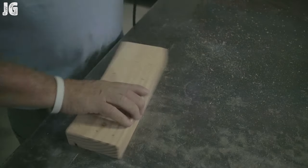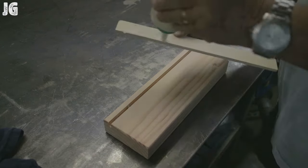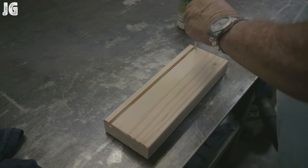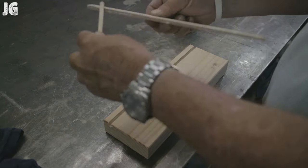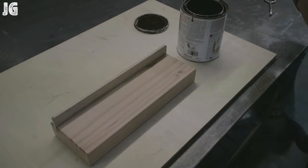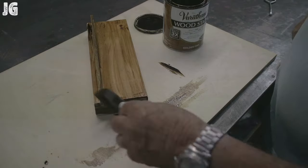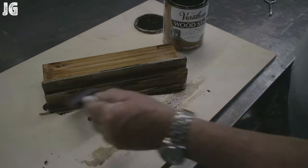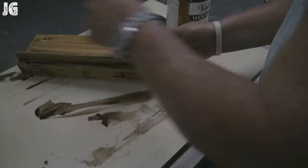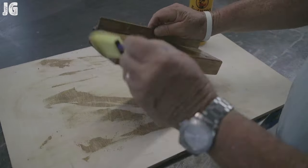To make everything look nice and crisp and clean. Once I got that done I just took some glue — that's just how I'm going to attach this piece of quarter-inch plywood. I'm not going to use any fasteners; there's just no weight, no structural value to this whatsoever. Just some glue — I think it's in there forever. Then it's just a coat of golden oak stain, which kind of matches the theme of my cabinets in the garage. Once I did that I wiped everything off nice and clean, let it dry a little bit, and added some beeswax orange oil for a nice glossy finish.